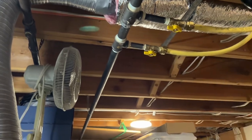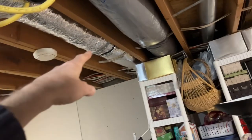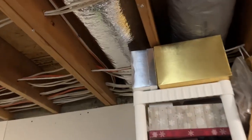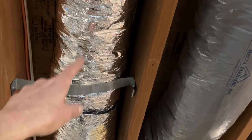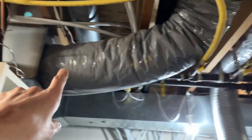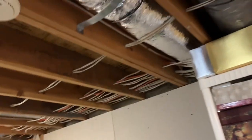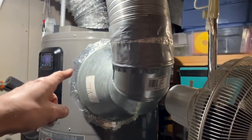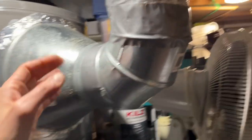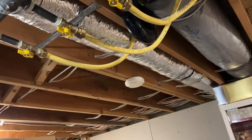On insulation: don't wrap it all the way. I probably went way further than I needed to. I think five feet in is enough — if anyone has a definitive answer to that, I'd love to know. I've pulled insulation off the rigid piping in most other spots. This big section is why I insulated it, because it connects to the fresh air return from outside for the furnace. These units also dehumidify — the air coming out is dehumidified and super cold.